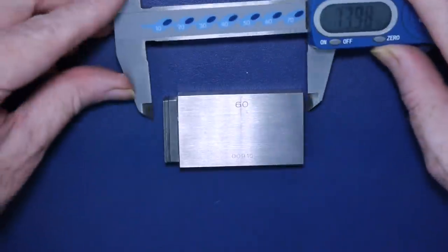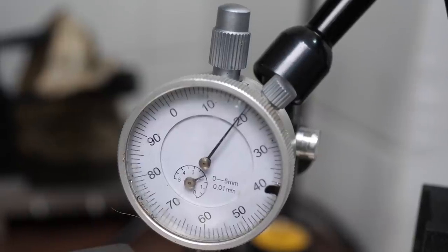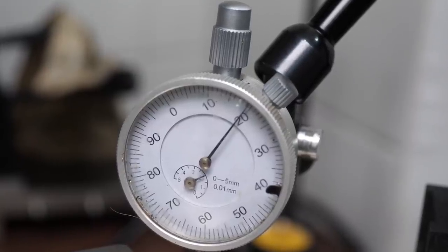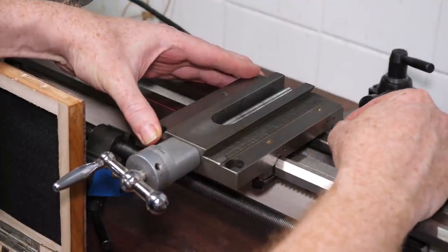The test stack can be accurate to 0.01mm, though these calipers are only accurate to within a couple of hundredths. The distance I'm trying to measure under the saddle is just over 1.8mm, and there's simply no way I can make a stack of 1.85mm or any other hundredth-size around this dimension.